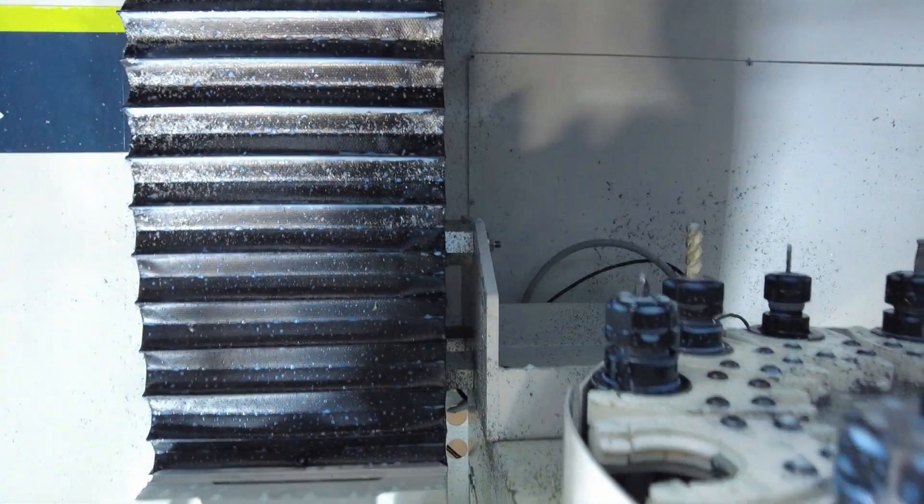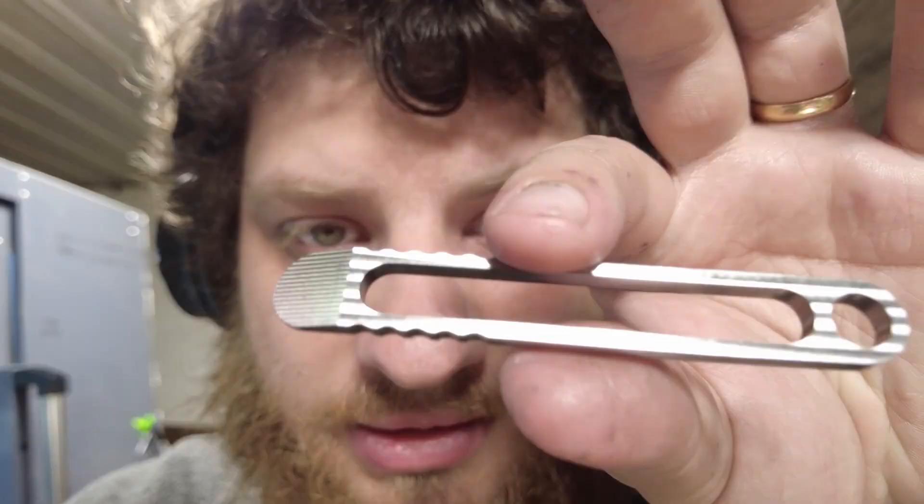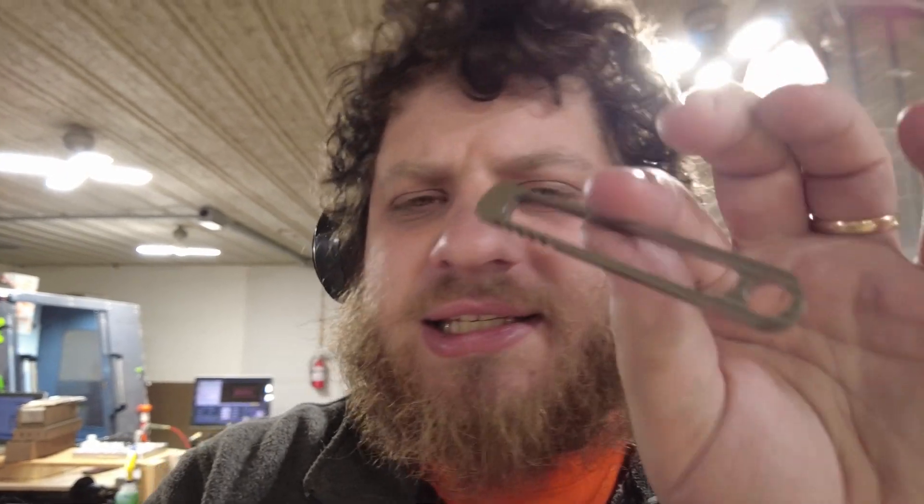On this one I went kind of slow. On the next one I'm going to take shallower passes but with a more aggressive feed, and maybe that'll do it. Looking at it, the finish on the top of this bar is actually really good. Maybe saws just sound like that. Good finishes with a bad sound could mean it's burnishing the material — I'm cutting too slowly and it's rubbing the material until it shines, which is a good way to get good finishes but bad for tool life. I want to make this $100 saw last as long as I can. The part itself looks great. I'm going to put these through a three-stage tumbling process and get them a nice polish. This is a good starting point — the finishes are basically as good as they're going to get off my machine.